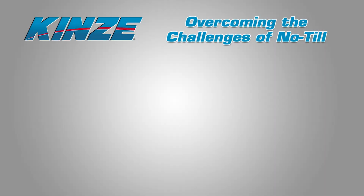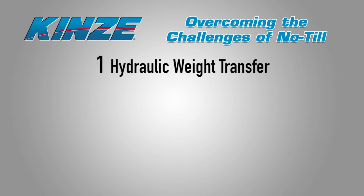So we realize that there's a variety of challenges with no-till. So we have 4 key things that we look at. The first one is going to be specific to our 3600, 3660, and 4900 planters, and that's hydraulic weight transfer. And what hydraulic weight transfer will allow us to do is distribute the weight evenly across the width of the planter. That does 2 things for us. That helps reduce potential compaction, and it also helps us in our depth control as we keep that toolbar level and we keep the wings in the ground.